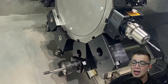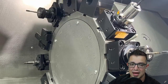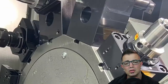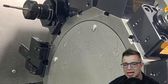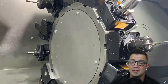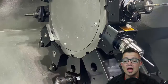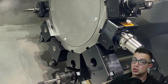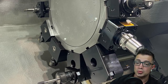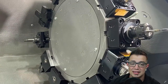They've got side-mounted boring bars — a little bit of everything in this setup, which is just phenomenal. It looks like they've got the half-index positions, but they actually aren't using them with this Capto system. With Capto you can take advantage of that as well — they do have the half-change index systems — however that does reduce the size of tool you can hold. So this customer has gone for the larger tools with fewer positions.